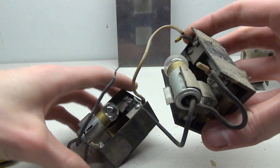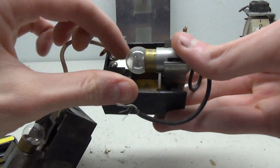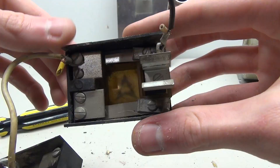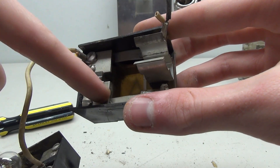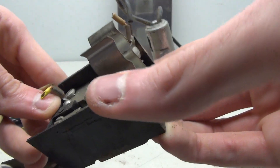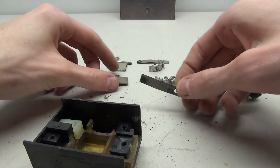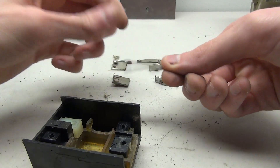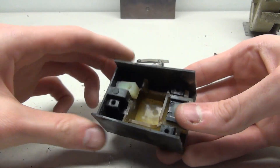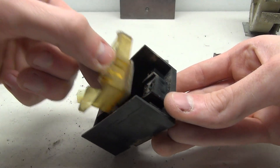Now here we have one of the buttons. This is a call station so there are only two buttons. On the back we first have the lamp — this is what the bulb looks like; it uses this type of base. The lamp socket can unclip from this clip here. There appear to be two independent contacts on this button: one connection point here and one here. When you push in the button cap it pushes down those metal bars, which completes the circuit onto these contacts here. Pulling out the metal contacts, you can see it's just this metal piece that pushes up against the other contact. They're kind of dirty so I'm glad I pulled this apart. There's also this little plastic piece which comes out — I'm not totally sure what that's for.